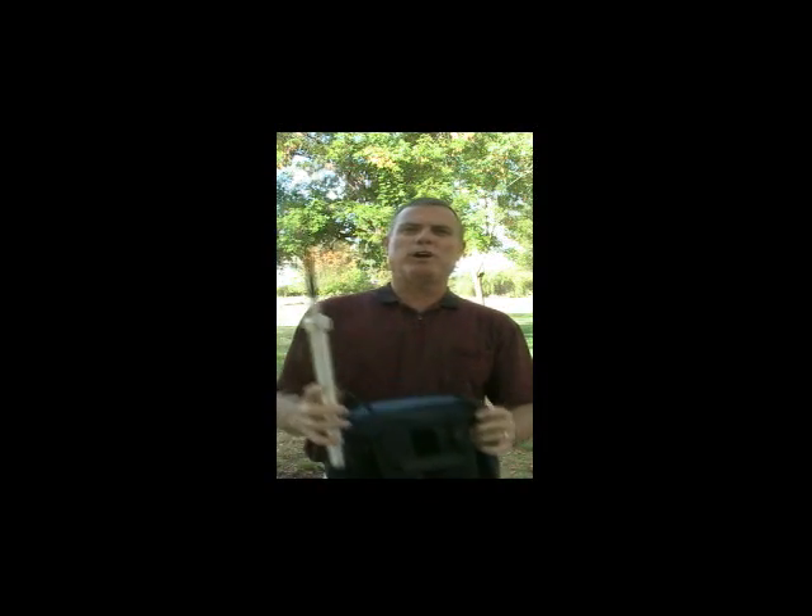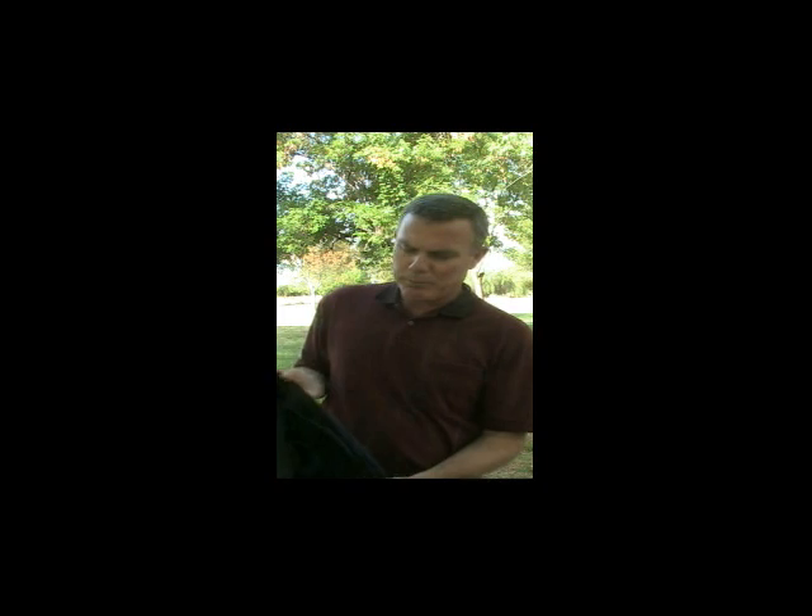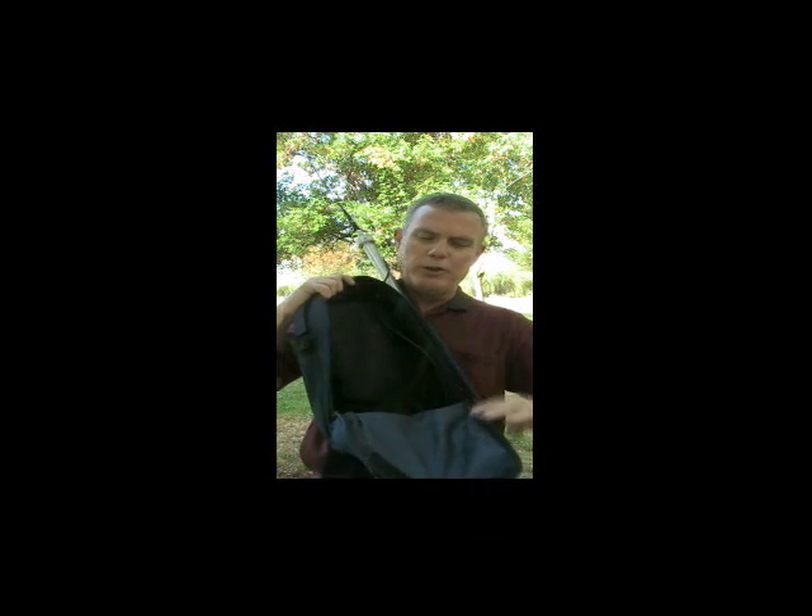Finally, we have the backpack. This backpack was really well thought out. This is the external antenna for your UHF radio. Inside the backpack, there are straps that securely mount the ProFlex 500 without any cable crimping. You can actually leave it open — you don't need to close it; it holds the receiver that snugly. We also have a very nice set of cables so that you're not tethered to the pole. These are quick-disconnect LEMO connectors — coaxial LEMO connectors — that make a very nice push-pull assembly.